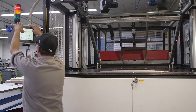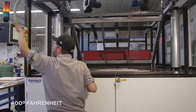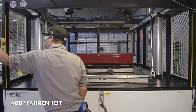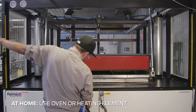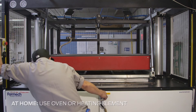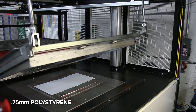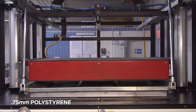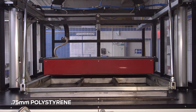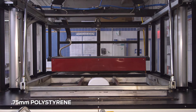Using this process, our plastic was heated automatically based on the settings programmed. Typically the plastic is heated evenly somewhere around 400 degrees Fahrenheit. Once the plastic is heated evenly, it is pressed against the 3D printed form and the air is removed through suction. Hold the sheet in place for a few seconds until all of the air between the plastic and the form has been removed.